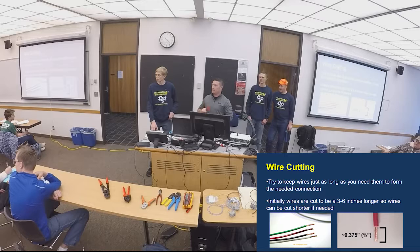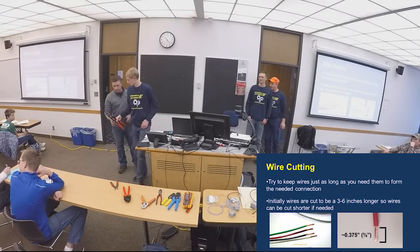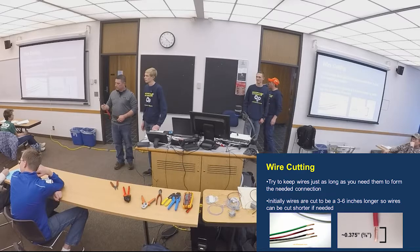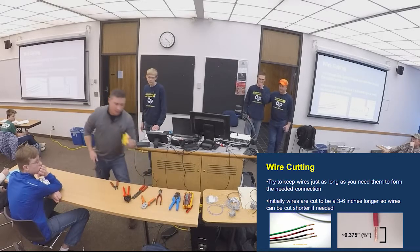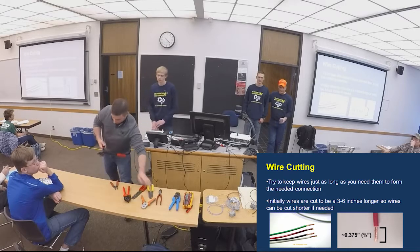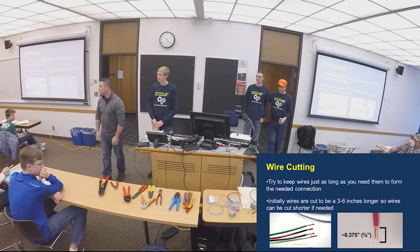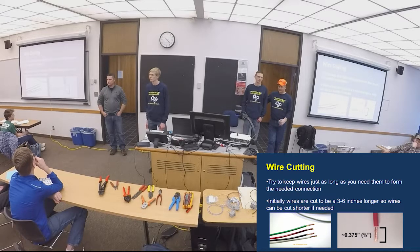When making the power connections for the battery, the wires are a lot thicker than what we used to. We generally use an X-Acto knife to strip it, and then take a hammer and pound down the connection at the end. Is there a simpler way to do that? Just get it really big. Well, this one's specifically designed for those types of connectors. This crimper will do smaller ones, but it's designed for 22 to 10 gauge. What are your battery connections, like 6, 8? They're thick. They're big ones. This one's going to be able to take on a much bigger one, and you've got the torsion behind it, so you get the tight connection. You won't have to work as hard. They also make a wraparound wire stripper, which is just a knife that sets a depth. You spin it around, slide it off, and pull it out. That's for multi-wire, and you can also use it for battery cable.